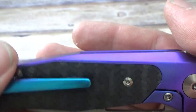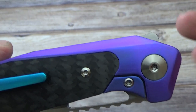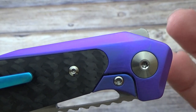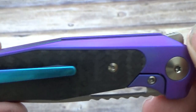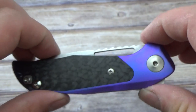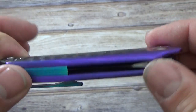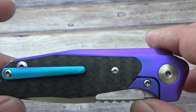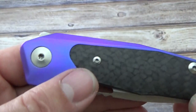If you don't get that steel contamination off and you try to anodize, your colors get all jacked up — electricity goes crazy, it's a real pain. This one has a slight orange peel to brushed satin finish. The Bling actually comes buffed out but wire brushed, giving a shiny textured finish. Well, that textured finish was full of steel. I tried to anodize it once after Sonic cleaning, acid rinse and everything — it went crazy. But I was so happy once I got it finished.